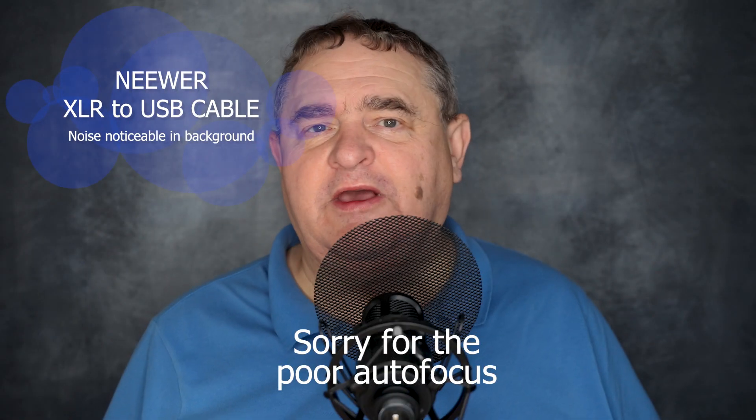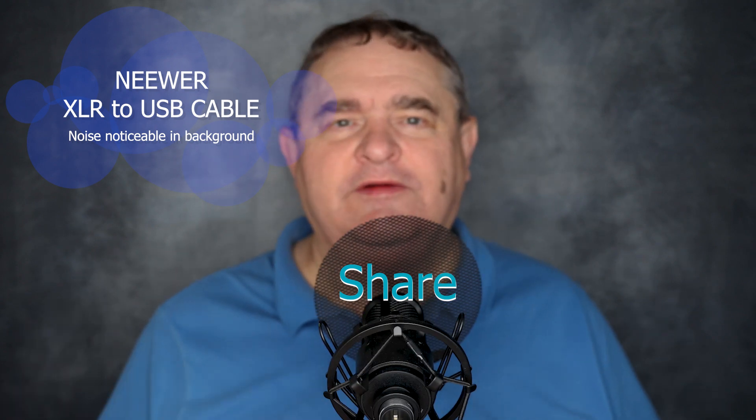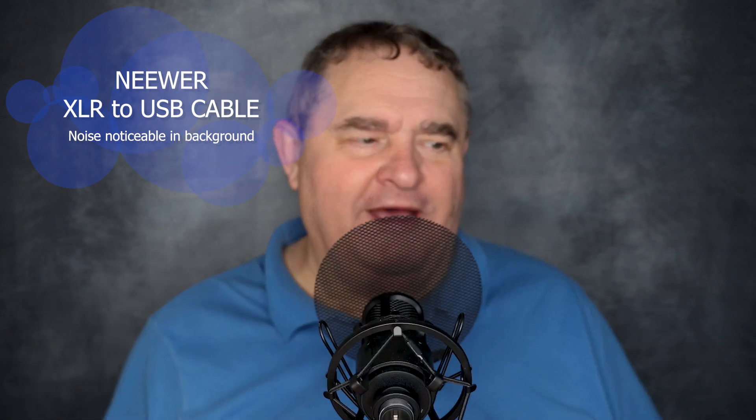I've now connected the microphone to the computer using the XLR to USB cable. It's a plug-and-play device, so the computer automatically recognized it and set it up. However, I did go into my Windows sound settings and turn the input slider all the way up to 100% because the output from this cable is low. In fact, looking at Adobe Audition, it looks as if I'm peaking in the region of around minus 25 dB. I've normalized the audio so that it's about the same level as the output from the 2i2, but you can hear that that's also raised up the noise. If I stop speaking, you'll easily be able to hear it.